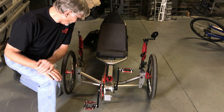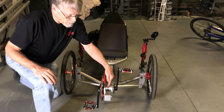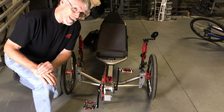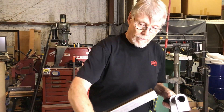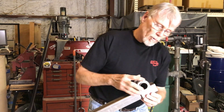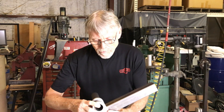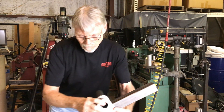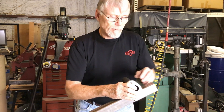I'm going to show you this front crank — I think it deserves a little bit more scrutiny, and I'll show you how this works and why I designed it this way. This kept me up a couple of nights. Here's a close-up view of this bracket: this is your normal chrome moly bottom bracket housing, and we're simulating that with this piece of chrome moly steel. It typically bolts on like this — we have a plate on the bottom with four six-millimeter bolts, and this is made for adjustment of your crank. You can adjust it to the bottom or to the top, with about a 12-inch range of adjustment.